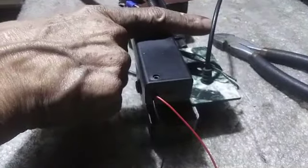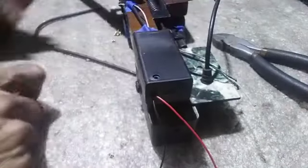I think it'll make the wiring a little bit easier. When you're trying to send three or four, anything more than one wire on one connector can be questionable. Really, it's better to take one wire and wrap it around the other wire and connect the two wires together and then have some extra wires sticking out that you then put through the connector. But in order to avoid all that, you just have one wire coming from everything and you just bring them all together and do it that way.